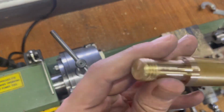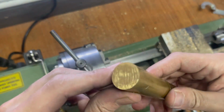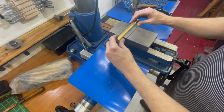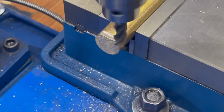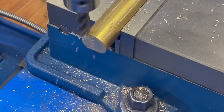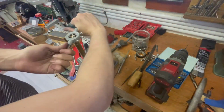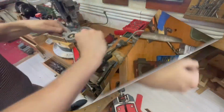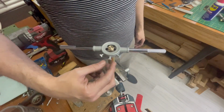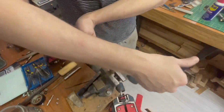They seem to be forming all right. I just need to get a couple of wee flat spots in this side here, look. Then I'll just do it on the vise. See, really, what I should have done, think about it now, I should have screwed that one down to squeeze the die open. Oh, I think of that now when I've done it.